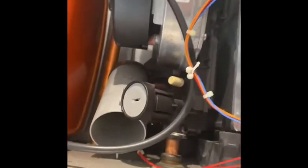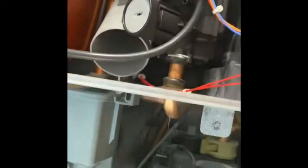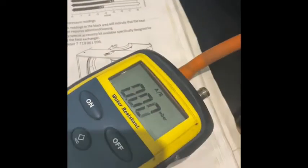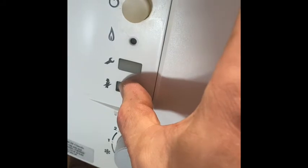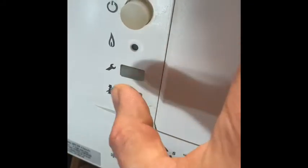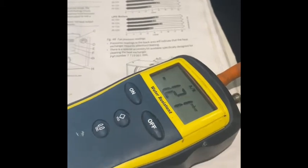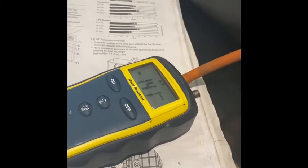So the fan pressure test point here is just this little thing here, so we whip that off — it'll give us a negative reading, it's obviously the fan sucking — and we bang our tube up. What we should do is bang it into maximum mode, so I'm just going to put my manometer there so we can keep a decent eye on the readings. You're going to get a little jump every so often. I'm going to bang it into service mode. This boiler has been running for about 10 to 15 minutes. I've also put a cleaner in the system, so I'm comfortable with whatever readings we get. The boiler's up to temperature — when it ramps up we'll see what the readings are.